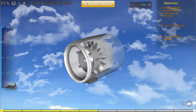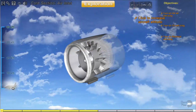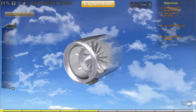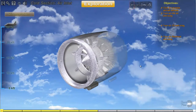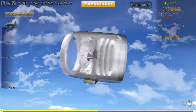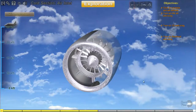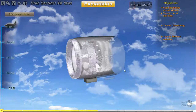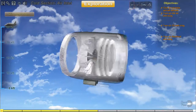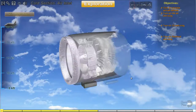Something new to explore. At high altitudes where the atmospheric temperature is low, icing can start to form on the non-rotating engine parts. They are commonly formed on the nose cone, nose cowl, intake struts, and inlet guide vanes. Once icing has formed, they may break away from the surfaces and cause foreign object damage, or FOD, to the engine blades.